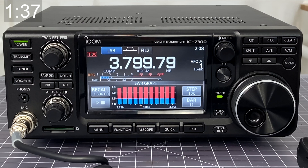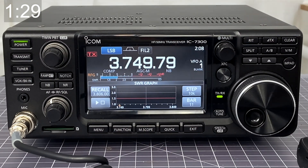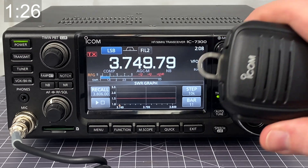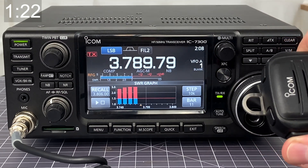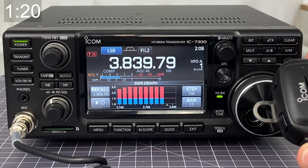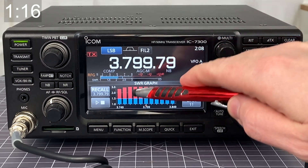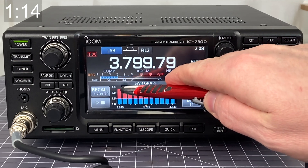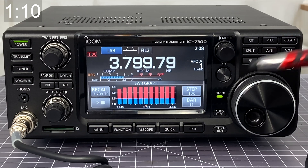Now for me, I switch between antennas fairly frequently, so I don't remember if this graph is from this antenna or another one, so I'm going to go ahead and create another graph to really test it. I clicked play and I'm pressing the push-to-talk button. I can see that I have some really high SWR in this particular range. However, right at the very beginning here, around 3.749, I can see that it is actually a little bit lower.